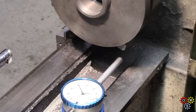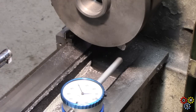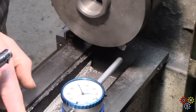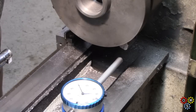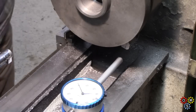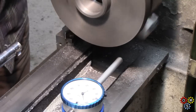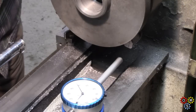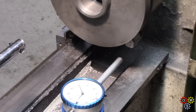I'm set up on the gearbox for my 6 TPI, and it's always a bit difficult to check on a scratch test, plus the fact this is a square thread anyway. So my check here is just putting a dial indicator touching the carriage, and I've got my handle in the spindle. I turn until it's just starting to move, go around 6 turns — and that's back on zero, and that's 1 inch. That's an adequate check.